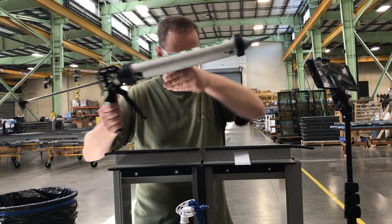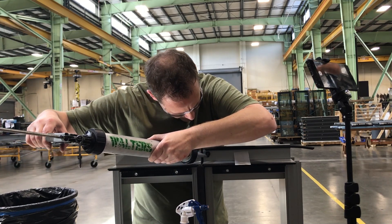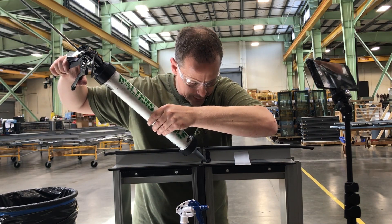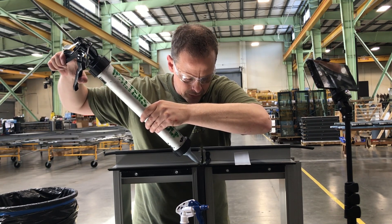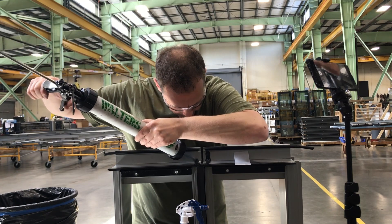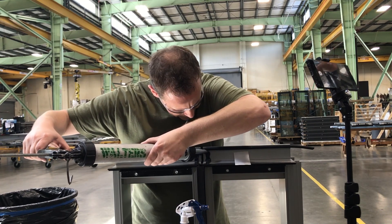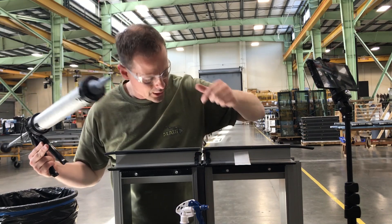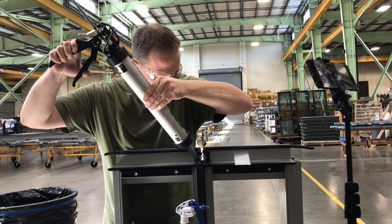I'm using Dow 791 black. When applying the caulking, I want about a 5/16 inch bead going over the top. If we have too much caulking it makes a mess, or it keeps the boot too high, which will interfere with the next unit that needs to slip over the top. Too little, and it's not going to adhere and will shear over time. Coming across the top of this chicken head — just like that. Now you can see I've outlined the boot going all the way across. Now I'm going to run a line of silicone right over the male leg, just like that.